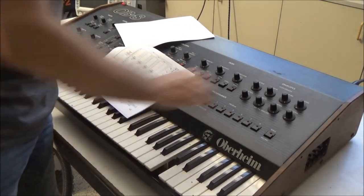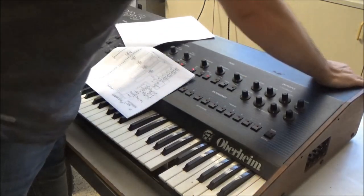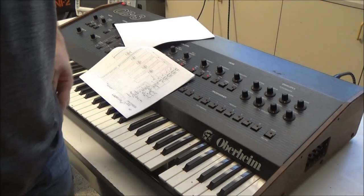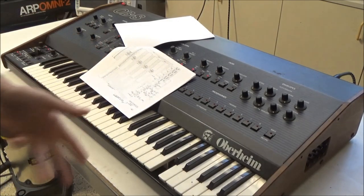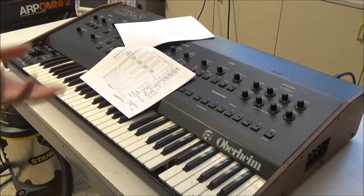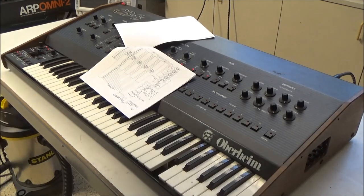And it's still not working. I'll go to the right output. And it's not working there either. So it's possible that this connector here, connector B, that actually carries the signals to the jacks is just disconnected, because otherwise things look pretty weird and odds-defying.